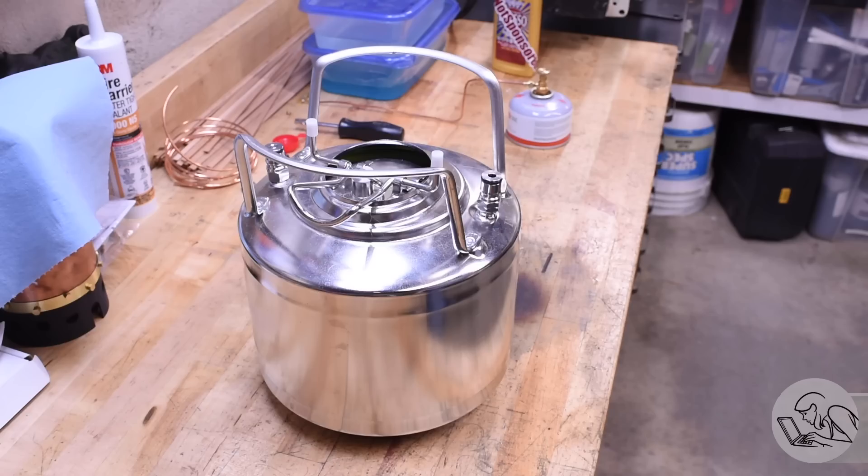The reason that tennis balls go flat is that the skin of them is ever so slightly porous, and so as they get bounced around a lot, the pressure inside can find its way outside the ball. The idea is you use that same property to re-pressurize them by putting them in a pressurized container for a long period of time and forcing pressurized air back into them through the skin.